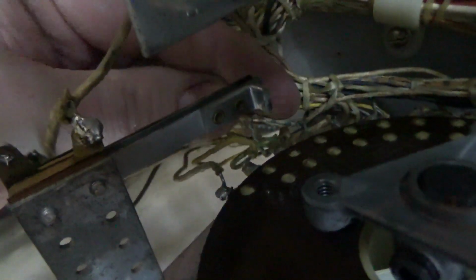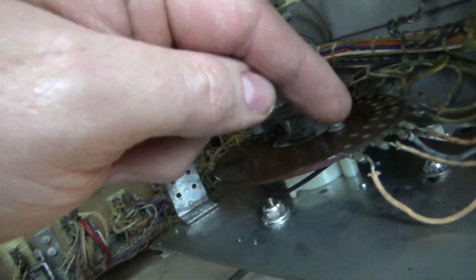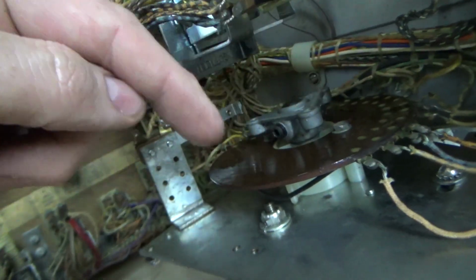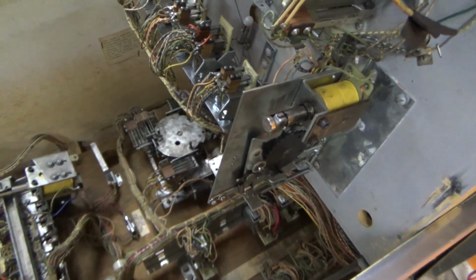So we're upside down. If you look at the rivets, that 4th rivet has a blue and a white wire connected to it. So it would connect that rivet backwards to this rivet. Now you might say, well, why are there other wires there? Well, one of them is the common. All of those rivets on the inside are all the same wire. And then there are 2 before it, 2 and 3. But if you think about it, it would hit those last. As it's going around, it would hit those before it got to the home position. So we'll figure it all out. But basically we need to line it up with the blue and the white wire, but my suspicion is it'll only line up one way anyway.